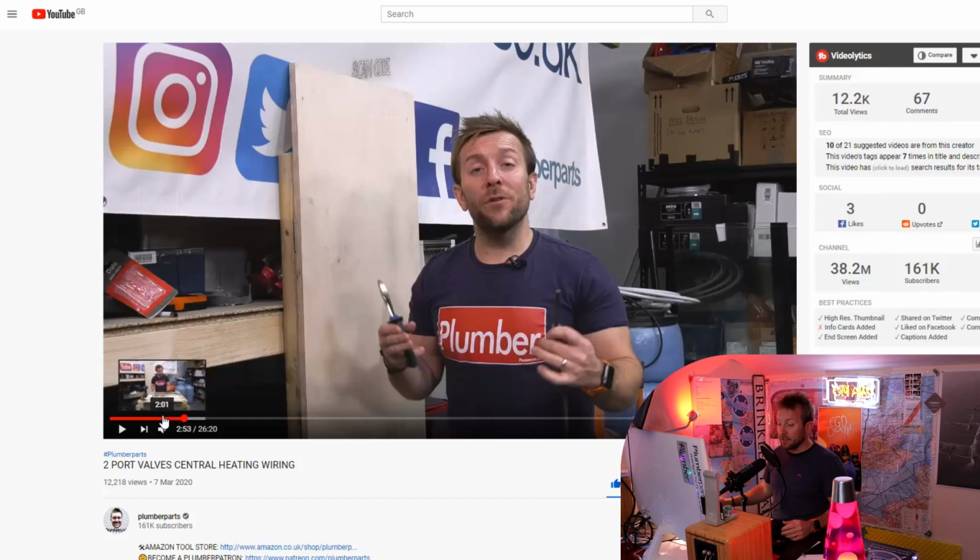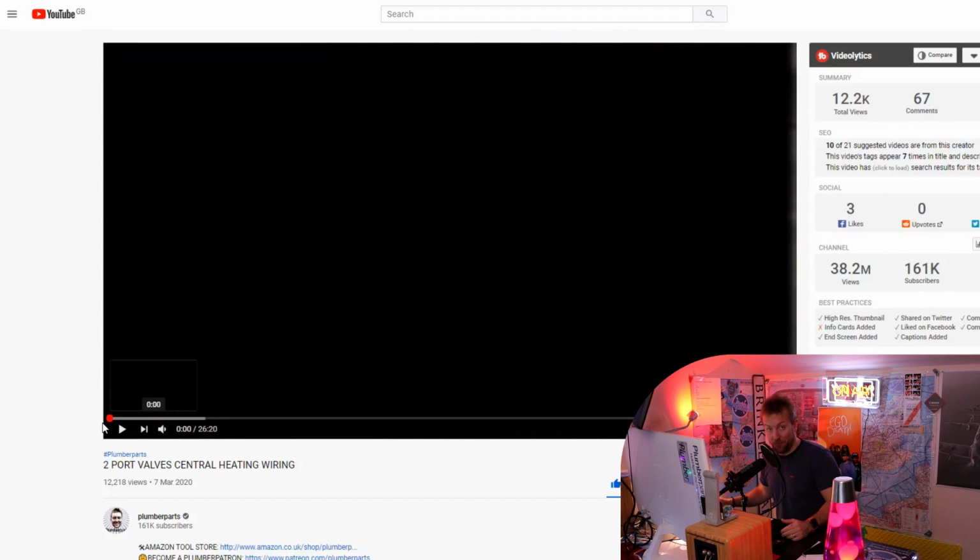Right then guys, last Saturday I released a video all about two port valves in central heating systems, and I wanted to figure out a different way that I could teach you about how the lives work for this and how simple they are to wire up. If you can get your head around it, it's all lives. The neutrals and the earths just go back to their little home. It's all about the lives and the switch lives, that's how it all works. Let's check the start of this little baby out.